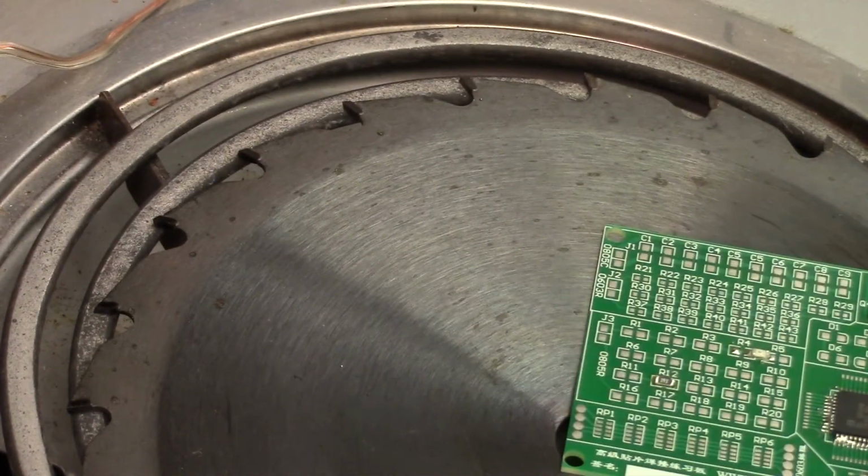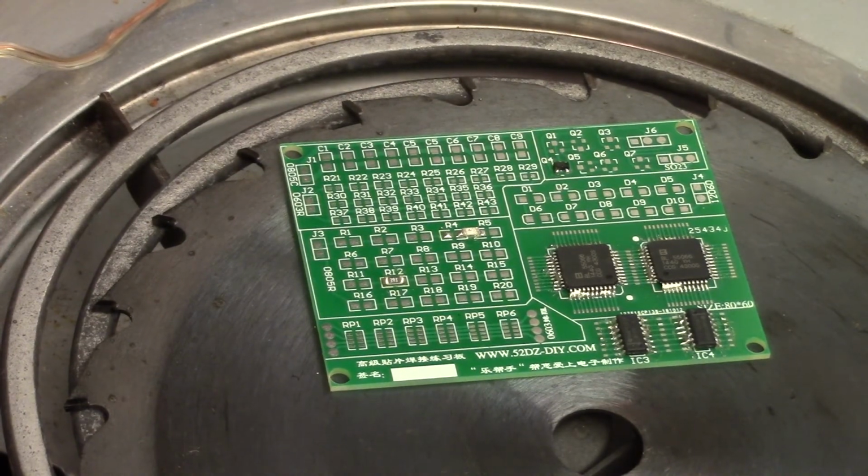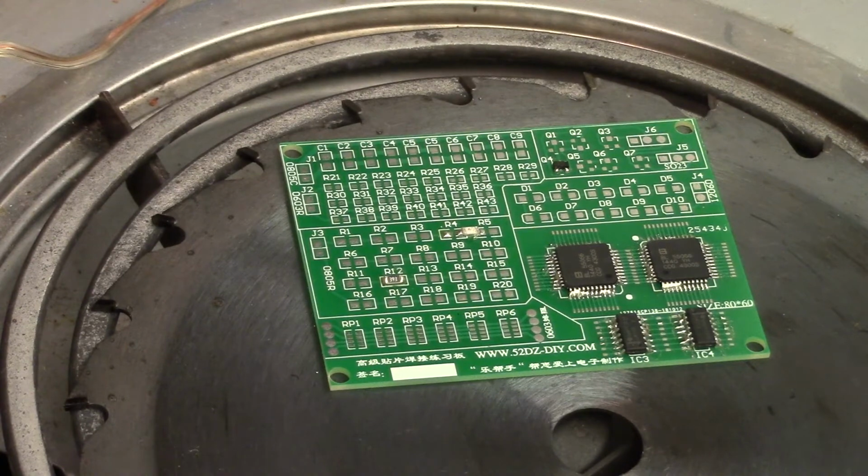So that's pretty much the way it goes. So it's important to follow the timing. You know, if you want to, you can build a controller, but all it does is just duplicate that period of 2 power cycles, and you don't really need a controller for that. So anyway, I think this will be a really inexpensive, under 20 bucks altogether, simple and safe and easy, gentle reflow process that pretty much anybody can do.